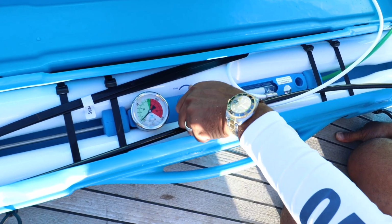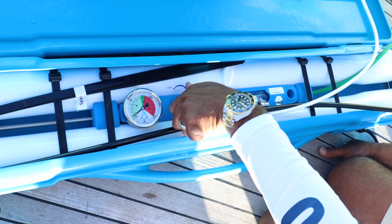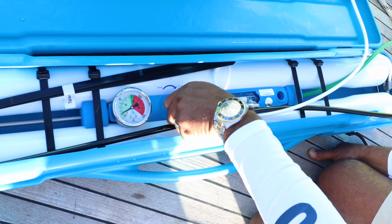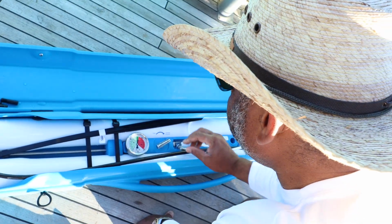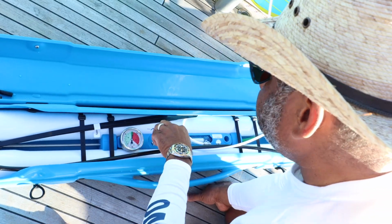Then we slowly turn the pressure valve to increase the pressure in the reverse osmosis system. The pressure is set to 55 bar or 800 psi. Then water flows out of the white freshwater product hose.